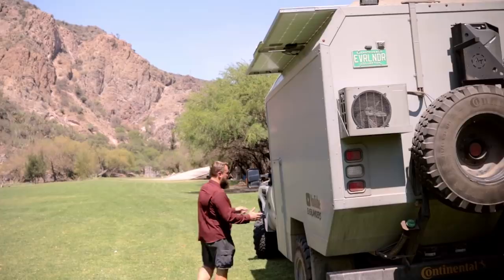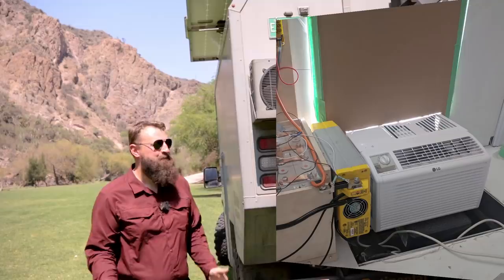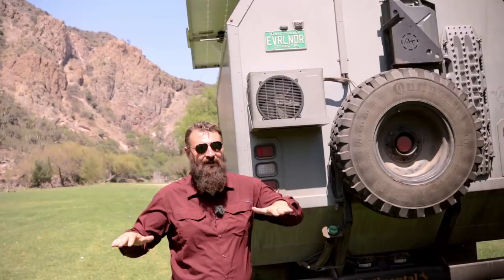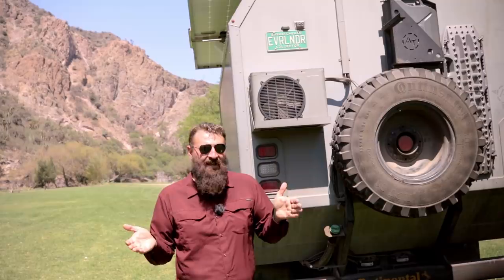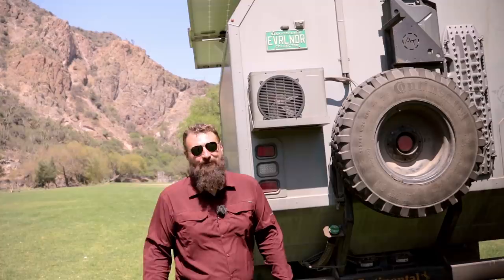First things first is the choice of air conditioner. When I first started with AC in this truck, I had a plywood plug in this side compartment door with a hole in it that fit a typical window-mounted window shaker air conditioner — a small LG, about 450 watts. They worked okay in Canadian summers, but those units depend on having a little bit of a slant so the condensation from cooling can drip outside. If you're at a slant like the truck is now, that condensation will run through the machine and drip inside your home.